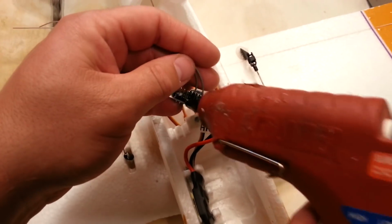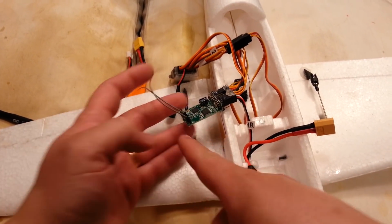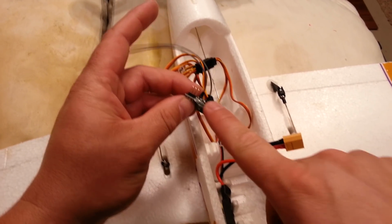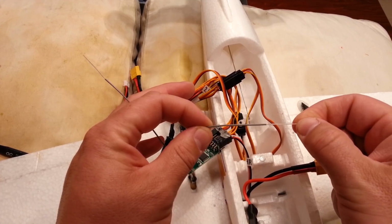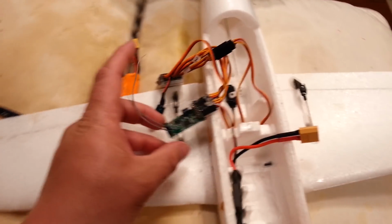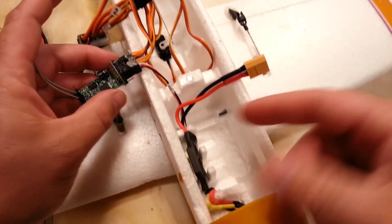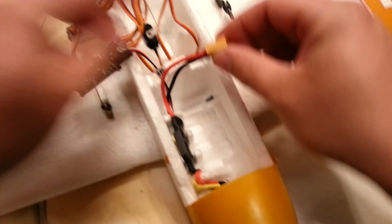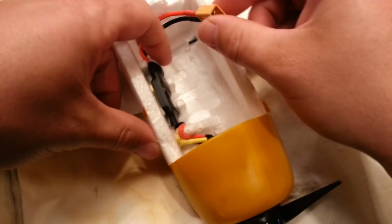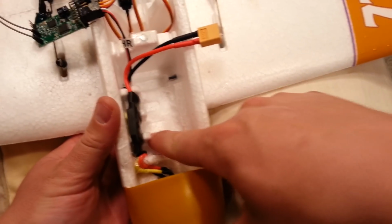And what I mean by strain relief is I want to relieve the ability for this to ever get kinked at a straight 90 degree angle, because this is like a small coax cable. So you don't want to kink it, it'll break. It is a braided cable inside actually, but it's similar to a coax cable, like an RG6 cable. You never want to kink those, they'll break. The copper inside. Okay, we have a little bit of thickness here to work with still.